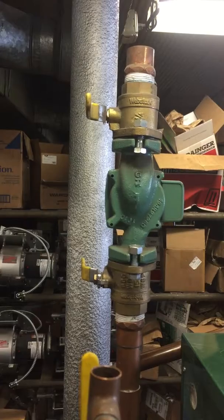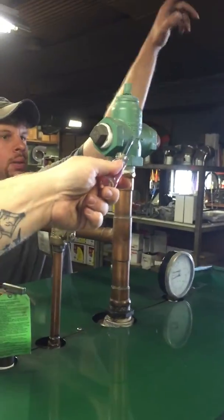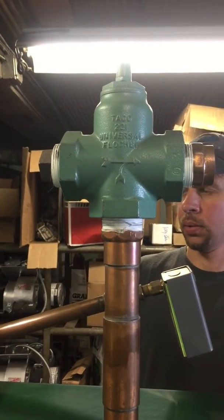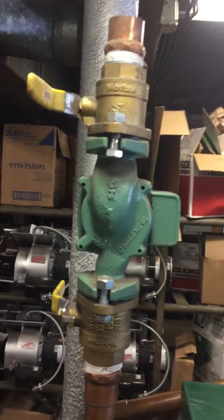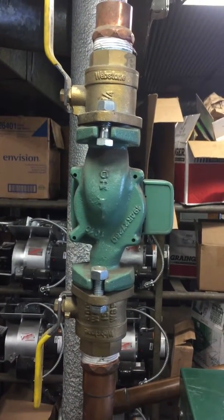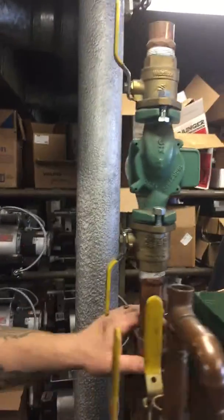It's kind of a push-pull effect — that's how a boiler system works. Right here it's pulling the water down and out of the top of the boiler. Where the flow check is over here, you'll see there is an arrow going out — that's where it's pushing the water out of the boiler. This circulator pump is actually being sucked from the radiators and whatever heating system you have up in your house at your different zones. Now as we get back down to this bypass T, let me go over there.